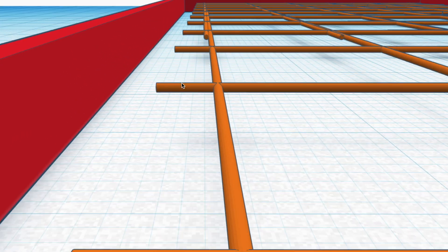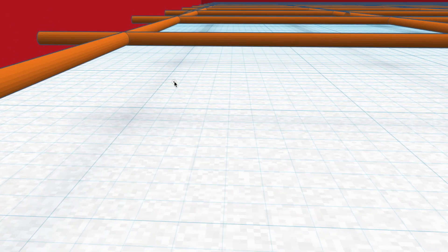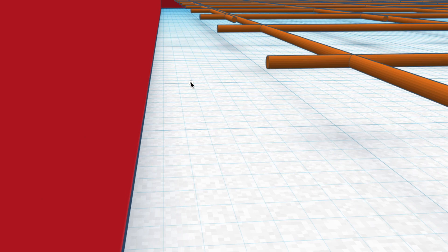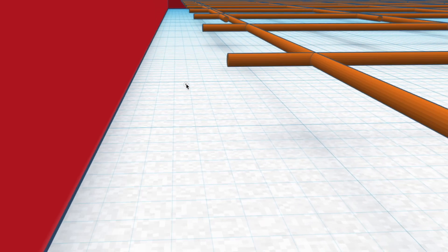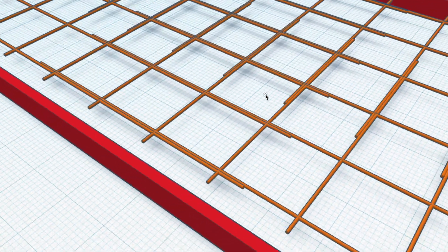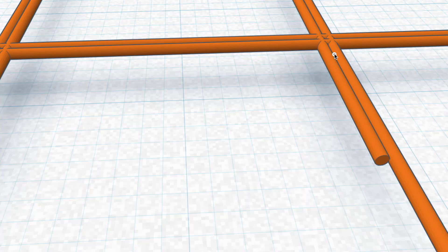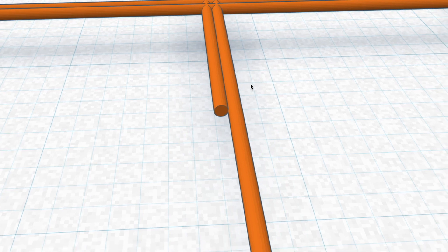Laying things out this way made it very easy for me to visualize exactly how much I was going to need. My slab is 8 feet by 16 feet, but they don't sell rebar in 8-foot and 16-foot lengths. At my local home center they sell it in 10-foot and 20-foot lengths. So for the long direction I used 10-foot lengths and overlapped them in the middle to avoid a lot of waste. Similarly, for the rebar going the other way, I took a 10-foot piece and cut it in half, then overlapped those two 5-foot pieces.